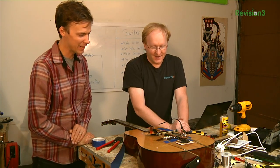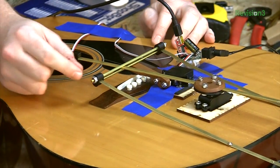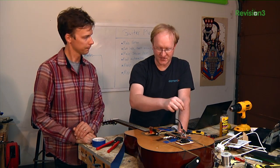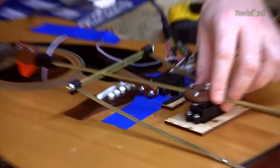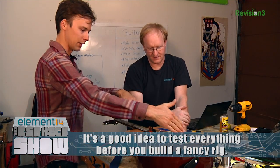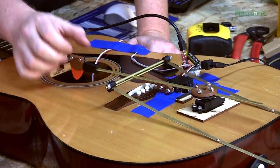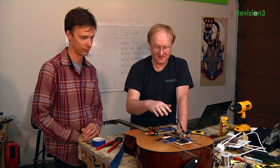I have two pillow blocks that the brass rod goes into. I used a die to put threads on either end so you can put block nuts on — this gives us a vertical position adjustment, so the pick can be up or down. You can do only down strokes, only up strokes, or have it automatic or manual. This Hamburglar-looking thing on the servo clamps the rod and is adjustable so you can bring it in or out, lengthening the arm — because you get different sounds depending on where you are over the sound hole.